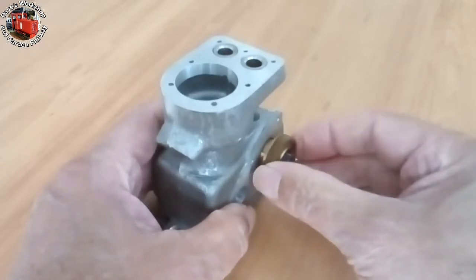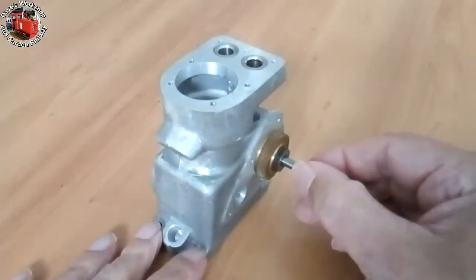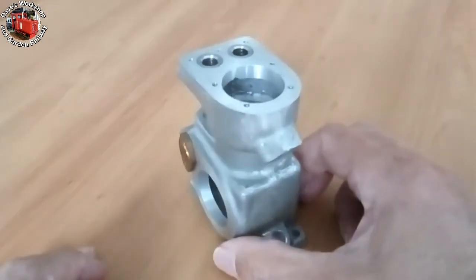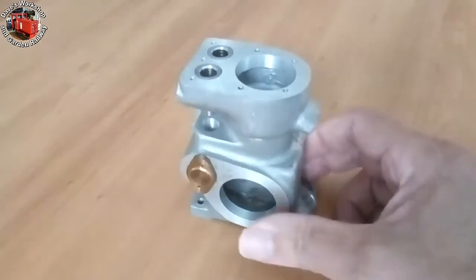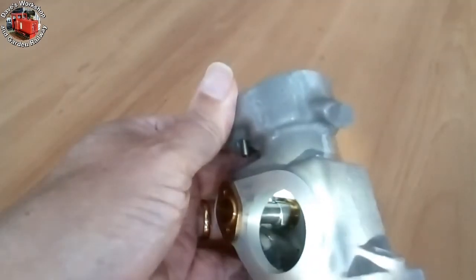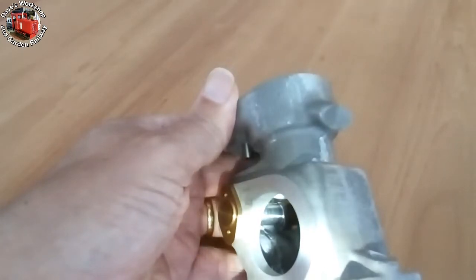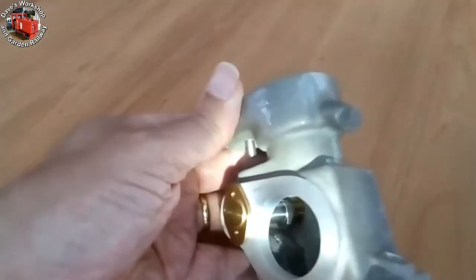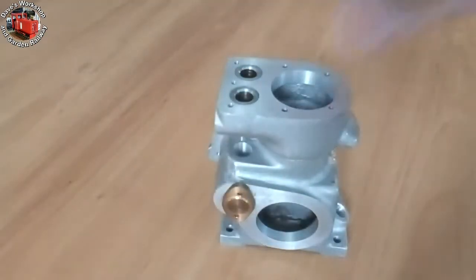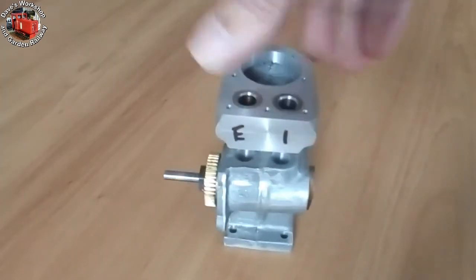Looking at the top of the casting, you can see the out-of-position cylinder head holes at the front — but these will be plugged and re-drilled. The front flange camshaft bearing will require much reducing before the main bearing housing can possibly fit. The exhaust and inlet positions have been marked on the casting. The valve liners and seats are all done, made and fitted years ago; the valves too are finished.